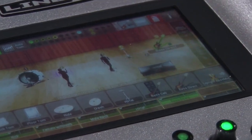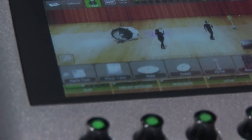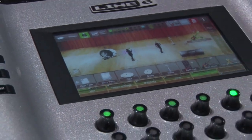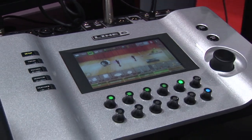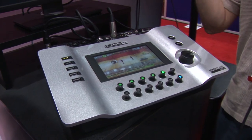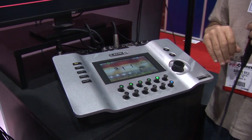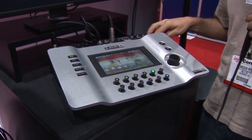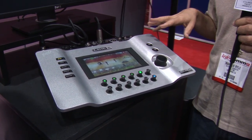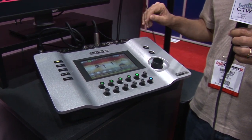There's also complete recording capability. The device has a thing called Quick Capture where it'll record 20 seconds of audio for all your channels simultaneously and loop. You can just play a chorus or have the drummer hit his bass drum and be able to play it back and adjust your signal after the fact. If you want to record more, you can throw an SD card in — it'll record all of the inputs as well as your stereo mix, all 24-bit, 48K WAV files. You can record your entire show, or record to a USB hard drive if you like.